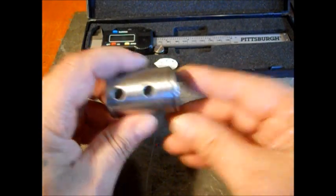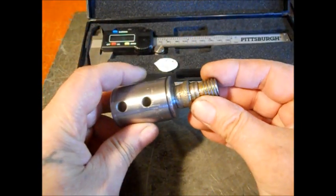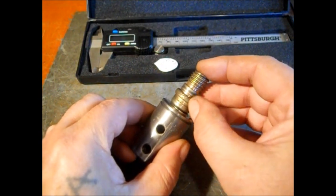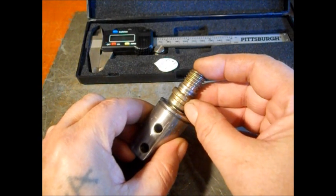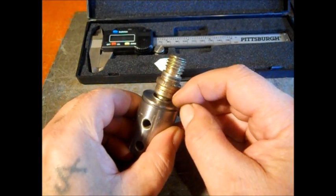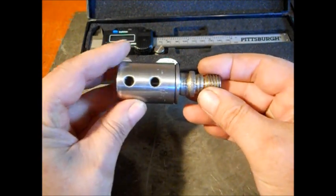Back to the story — we have to take some of the diameter off this so it fits in here. When we're done, we're going to braze it, because we don't want to risk welding it. We want to heat it up to an even temperature and braze it — it'll almost feel like sweat brazing, drawing the braze down into the metal. It's a really effective technique; I've done it on pieces before and they've held together.